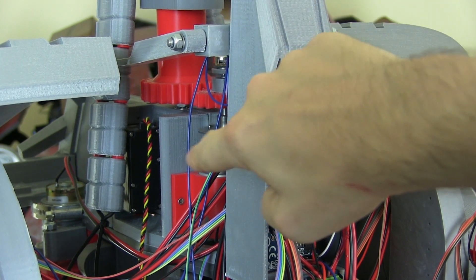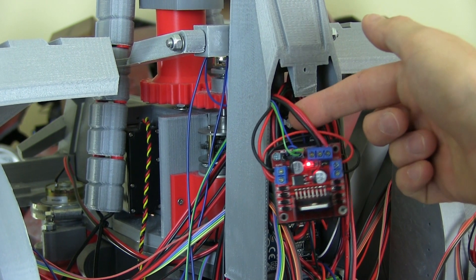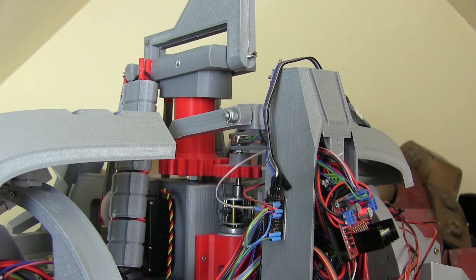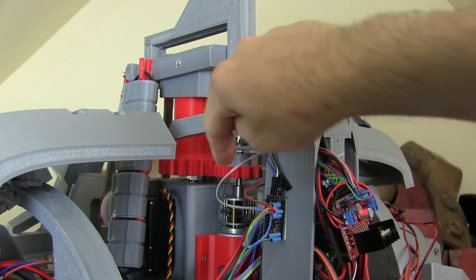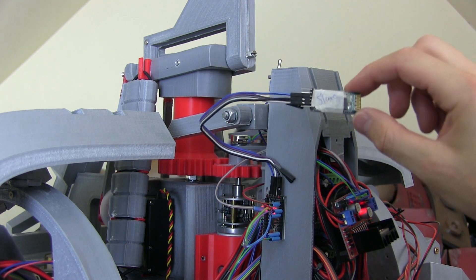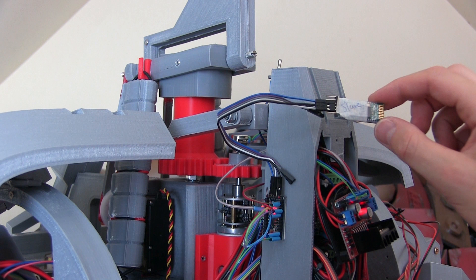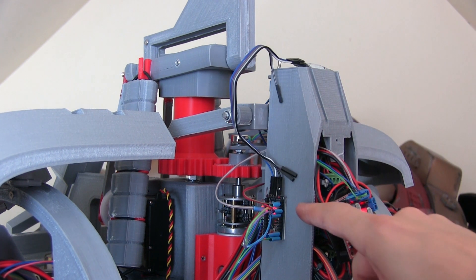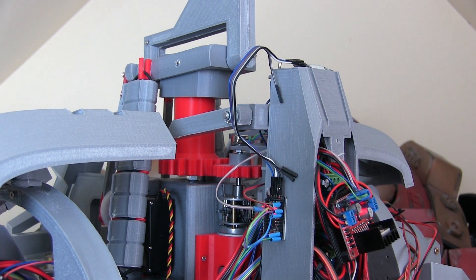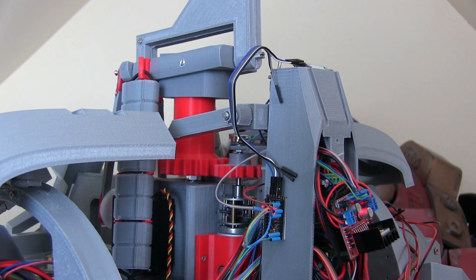The L298 wires are just poking out for now - it'll eventually go in the top where there's a space. The motor is wired into the screw terminal, with 12 volts coming in to power it. The L298 has its own five volt regulator so I don't need to wire five volts to it. I've fitted the Arduino Pro Mini on the side for now with a bit of sticky tape, with the Arduino Bluetooth adapter plugged straight into it. It's reading serial data from my little test transmitter for three axes - just one working for now - running PID against the potentiometer and turning the motor. If you want to see more about putting this together, check out part 15 which also has the code.